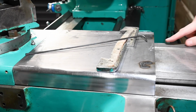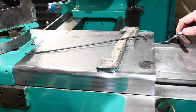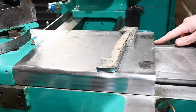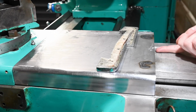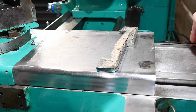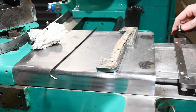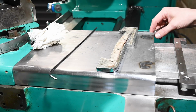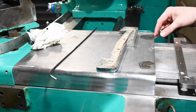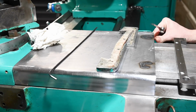All right, to quote Wes, there's your problem, lady. So I can't get a 2thou shim underneath right here. So this backup piece probably needs to be relieved on this center section here. It never needed to be all that close. I just measured it, or made it matching the wiper carrier, the original. So once we took this guy out, this corner dipped down and I can't get a 2thou feeler gauge under there. I can kind of drag it through, but it's not really as comfortable as I would like it.